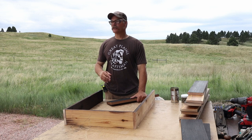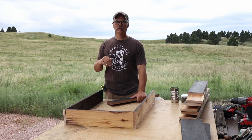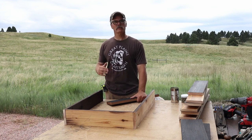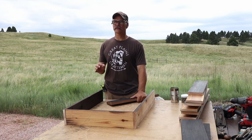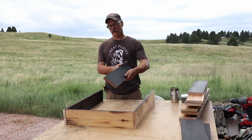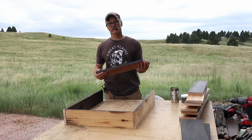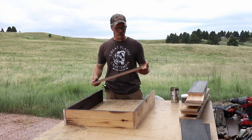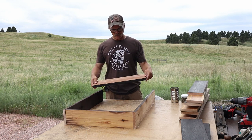And they come in certain dimensions, and when I measured the openings, I forgot that I was going to have to put a bevel on the sill to pitch the water out, and my mistake. So when you put that 5-degree bevel on there, actually I was going to put a 14 on there, or at least a 7, but we had to shave it down to 5 because I still think that will work, and I forgot to account for that when I built the rough openings for the windows. So we had to shave down the sills a little bit. They're more like 1¼ inches thick now instead of 1¾ inches, but they'll still probably be fine. So we had to resaw those down.